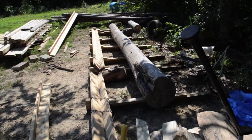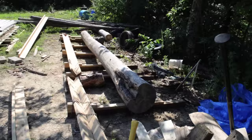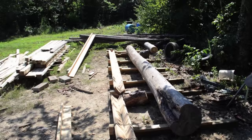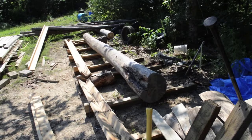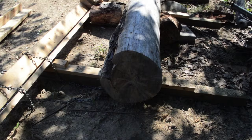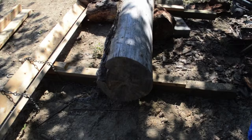I keep boards here so I have something to screw into. Most trees have a root end that's thicker than the top end — down here the widest part is 17 inches, and on the other end it's 13 inches. I raised it up a little on the other side so the heartwood, the center, is on about the same plane. As we cut and run down the track, it will cut level in relation to the blade, so keeping the centers on the same plane helps it square up a lot easier.